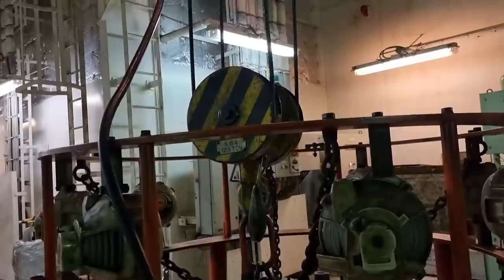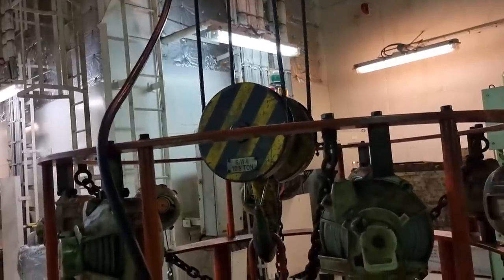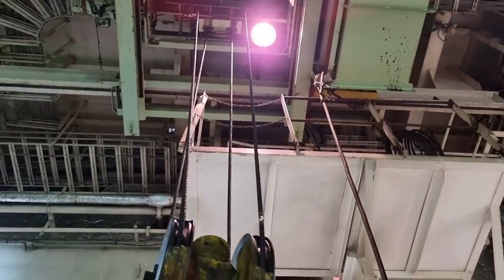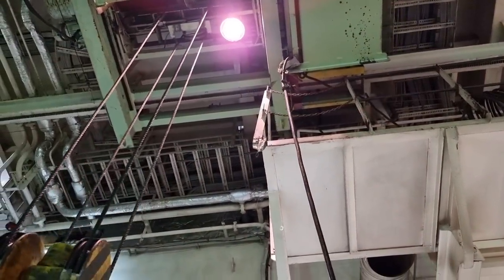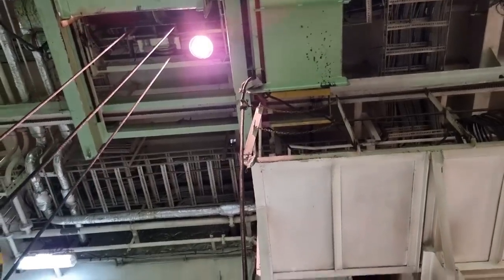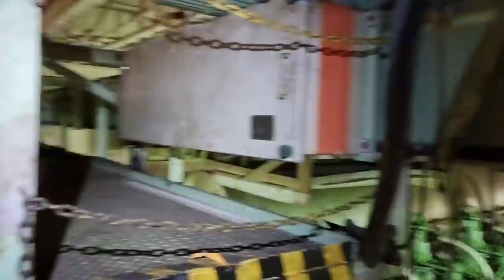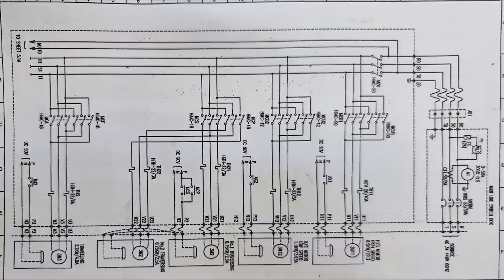You don't have high up and high down — I was thinking that the chances of the button being the problem is very low. I don't want to keep trying the system and burn the electric motor. That is why I decided to go up into the control panel and check what is happening on the control system. Please always observe the use of proper PPE, make a permit to work, and have a person on standby while you are doing this kind of job. The strategy here is removing the wiring connections onto the contactor and measuring the condition of the motor.